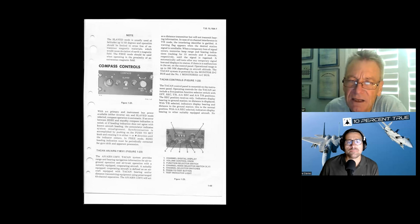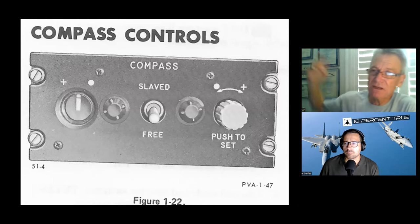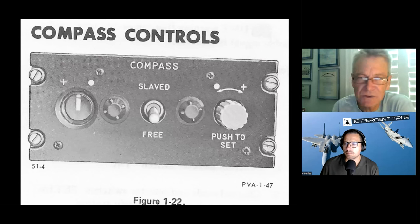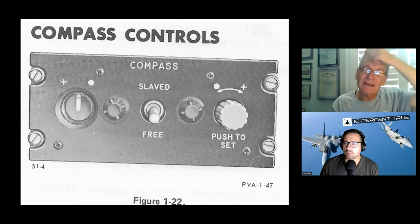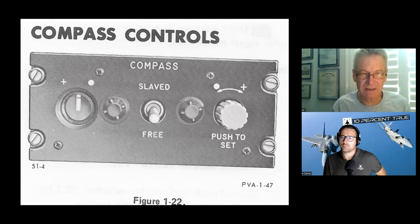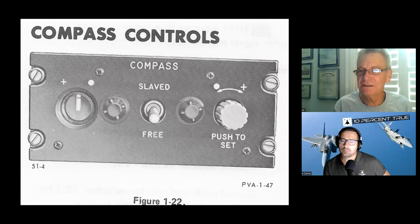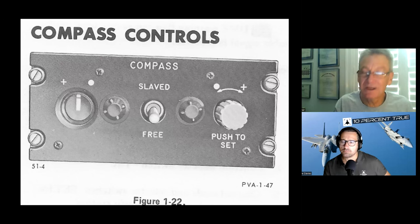Mode four on/off switch — normally in light mode so you'd see the reply light blinking when it was doing its thing; you could also put it in audio. Compass controls and the TACAN — the TACAN head was behind the stick. Most military airplanes have what's called a flux gate — a magnetic sensor located far from the electrical power of the airplane, usually out in the wing. It senses magnetic north and transmits a signal to the directional gyro. This control shows which way it thinks it needs to adjust. If you get on the runway and the heading is off by 40 degrees, you put it in free, push the knob, turn the thing until the heading matches, then put it back. In places where magnetic variation is extreme — Alaska, Washington state, anywhere with lots of volcanoes and iron in the ground — the variation is usually pretty crazy.